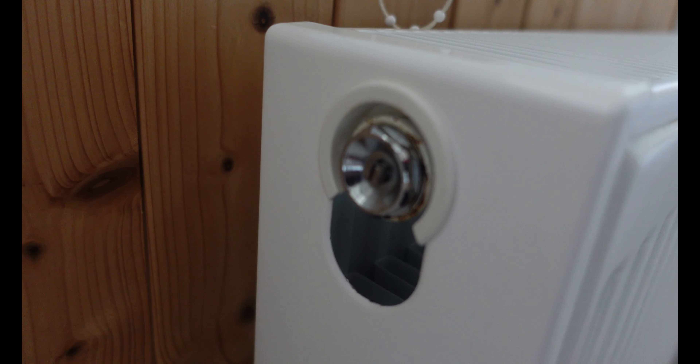If you get those particular radiators, you really are stuck with some trouble getting the bleed valves to come out when they start to get solid inside and won't undo. My favourite rad is the one that takes a half-inch or 15mm nipple in the end with the actual air screw into that, because you can just change that whole fitting - take it out of the radiator and put a new one in when the nipple for the air screw wears out.